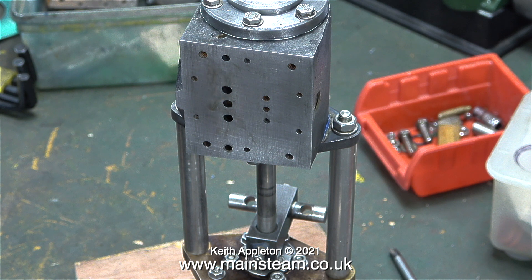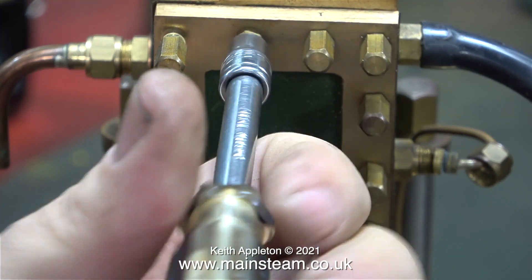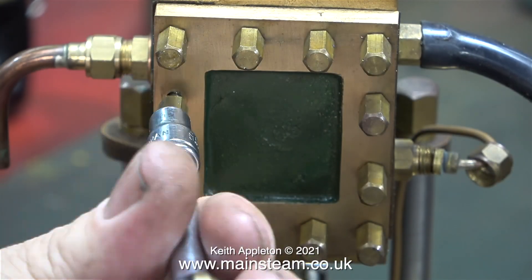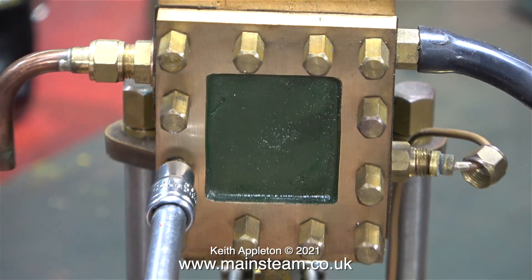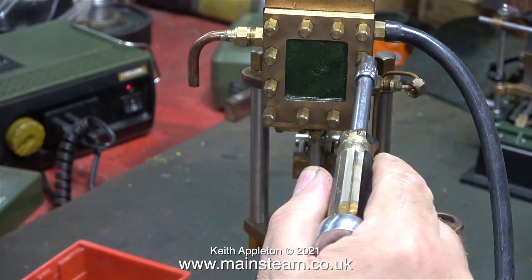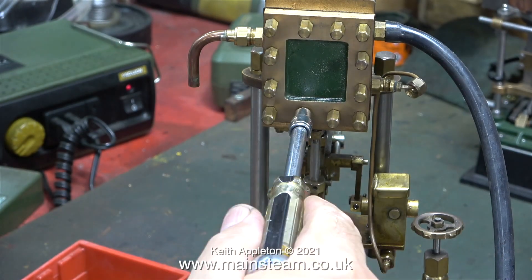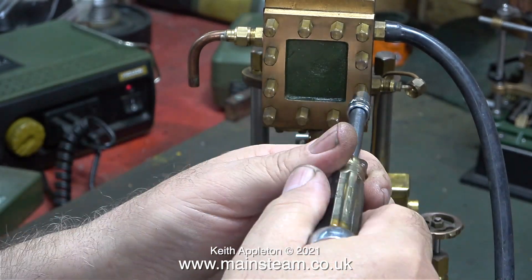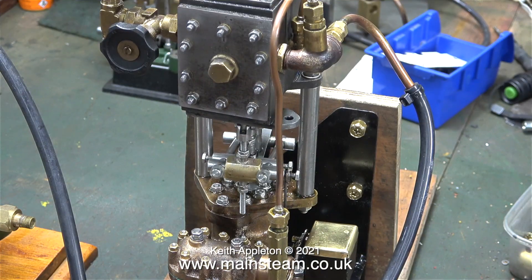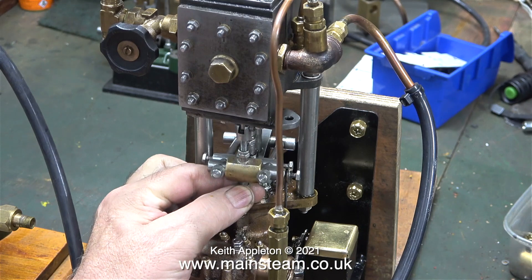Now that I know there are differences between the pump that I'm working on and the one made by Don English, I'm going to bolt Don's pump back together. On the steam pumps that Don makes, he often uses long pieces of brass hexagon to hold the steam chest and water chest parts together. Because the threads are long, you can really tighten up the parts. Over now to the pump that was in a really sorry state when I received it to repair it — now it's running better than it did, but it's not right yet.